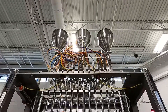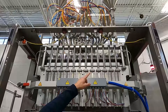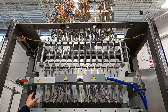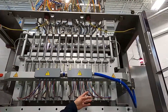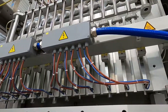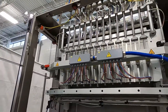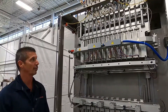As we continue down our process, you'll notice that our lances go inside our tubes where we're fed into 12 individual lanes. The individual lanes form and come through what we call our vertical seal assembly. We have 12 individual temperature control zones, which provides better temperature control with less fluctuation, leading to better seals and better efficiencies with less scrap.